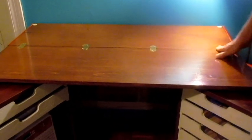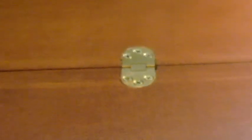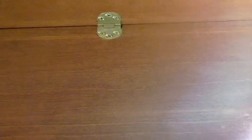And these sewing machine cabinet hinges I put in. I started to chisel them in. I used scrap wood, tried to chisel them. That didn't work very well. I tried to use my Dremel tool, and that didn't work either. So finally I just went back to my router, and I made a template and just drew out each of the spots for the hinges, and then cut them with the router using one blade for the outside, the actual shape of the hinge and the depth, and a second blade for the hinge portion in the middle, which is deeper. And I put four on there so it stays nice and level.